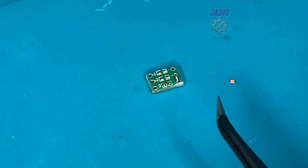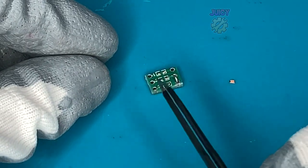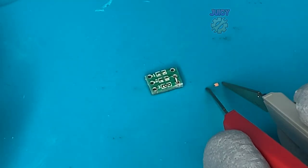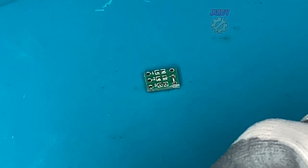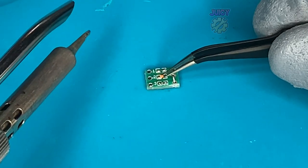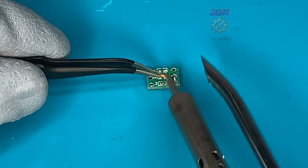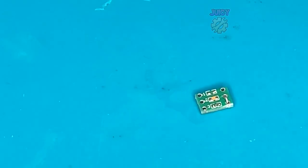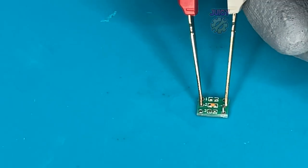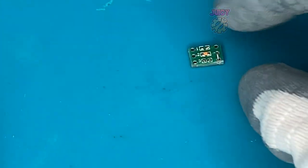This is the purpley pink LED - I think it looks more purple - and I'm going to put it in the middle so the circuit will be complete with the 220R resistor protecting it. I have some tweezers that will test the LED so we know which orientation to fit it. Now I'm going to put the LED on making sure not to burn it. To check that this works, I can use my test tweezers and test at each test point. Let's carry on and put on the red LED.